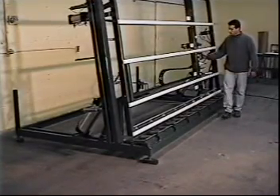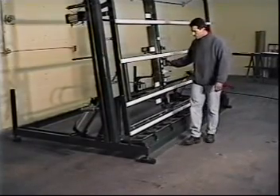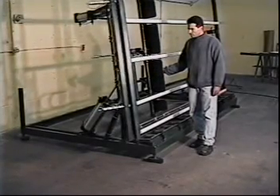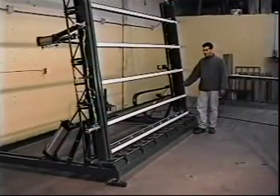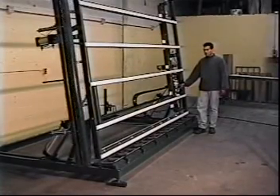Next, the right-hand squaring member is glided towards the window, which has been vertically transferred to the table. The brake is applied, the squaring members are moved into position, and then slid against the window. Notice how easily the squaring member glides across the frame. Finally, the squaring members are retracted back into the frame to receive the next window.